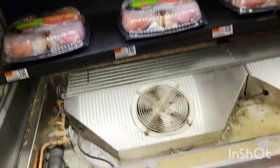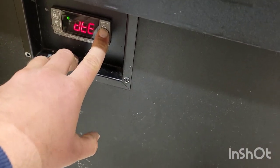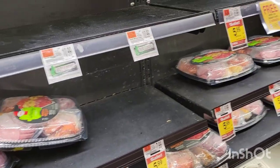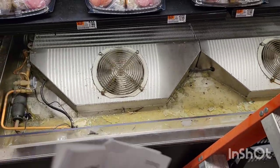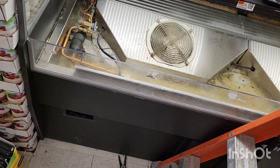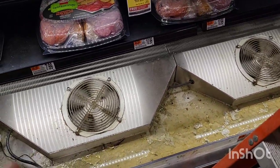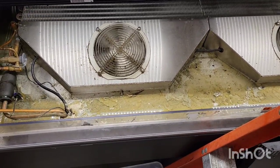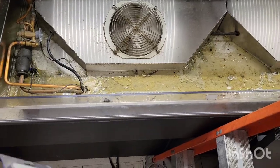That's everything we needed to do. To set it up like the Piper case: target 30-degree discharge air, 12-degree differential (HY), defrost every 6 hours, maximum 60-minute defrost terminating at 42 degrees. Now this thing is set up like the Piper case is supposed to be, using a universal replacement controller from the local United. Hopefully you learned a thing or two. Comment below if you have easier ways to do it. Remember the secret menu: three seconds Set and Down, then seven seconds Set and Down.